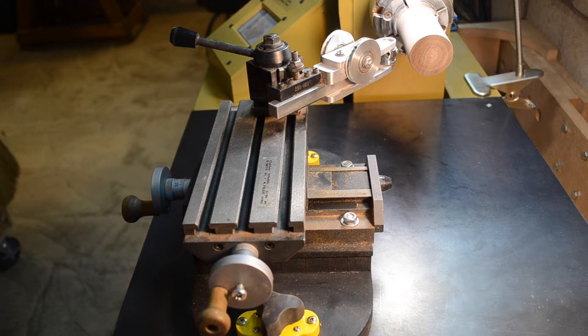I also have that motor separated from my head, so the noise is further away from me. And by having it further away, it's not so much in the way of seeing what I want to do. And finally, it theoretically transmits less vibration from the motor to the cutting head, so it reduces the amount of chatter in what you see.